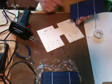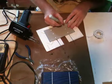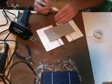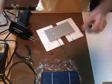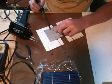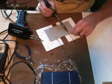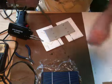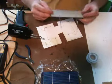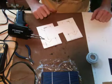So that's the tabbing wire — that's basically the negative portion of the cell. The positive side is the back, which is a lot easier to deal with. It's got these six pads — I flux those up just to clean them off, get a little bit of solder. The crappy gun or iron works for this. Just add a little bit to each pad; you don't need a ton, but you need enough that later on when you're getting the cells together you have enough to stick it to there. Anyway, that's what you've got when you're finished, and basically I'm going to put three of these together, then join them into a group of three.